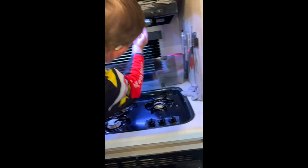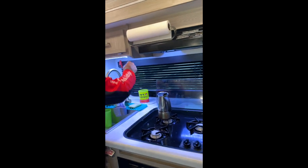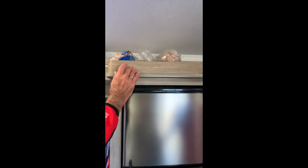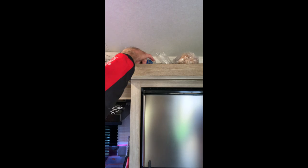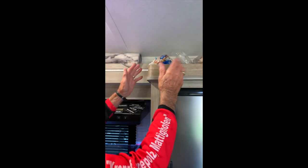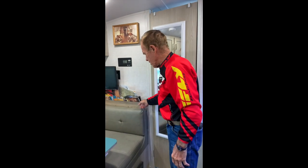You've got one little bulb here for all your light in the kitchen, so I went to Walmart and bought LED strips. This right here was just a flat shelf — this is flooring that I had left over. I rabbeted it out the back, bent it, and put it on with hot glue. Put a shelf here too for stuff.